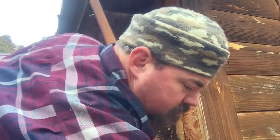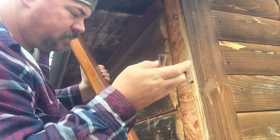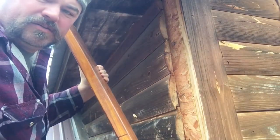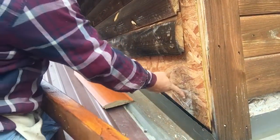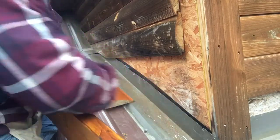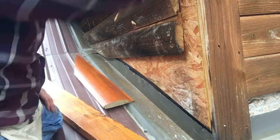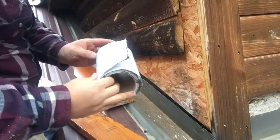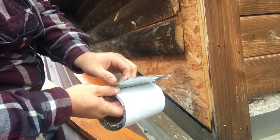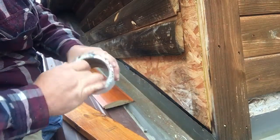So what I've done here is I took off the old wood — it kind of looked like this, and it's obviously not very good, rotted away. You can see here it kind of changed colors but it's still good. I used a zip board for the chimney and I really like the zip board system. Under here I picked up this flashing — it's a little different, it's got a sticky adhesive on the bottom and it's chrome on the top. The idea was that I like that it's sticky.